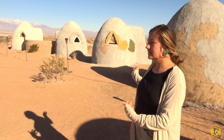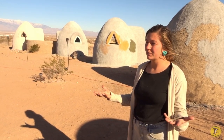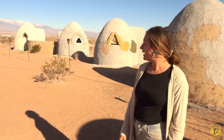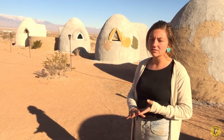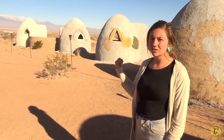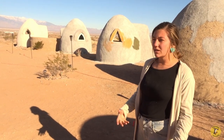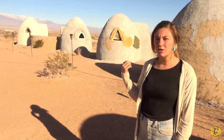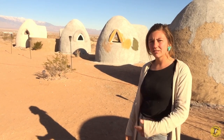This is a really cost-effective way to finish the exterior of a home, especially at this size. The clay, sand, and straw plaster is really cheap — under $200, if that. The cement coat — your cheap stucco — uses about two bags of cement, two bags of lime, and a ton of sand, coming in at around $90. Some of the domes also have custom-built doors and windows.